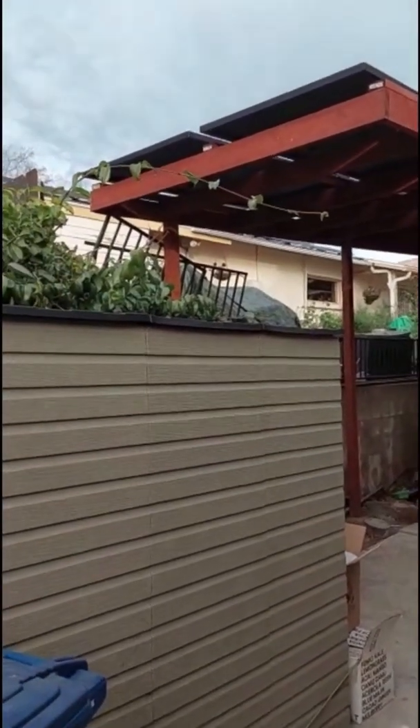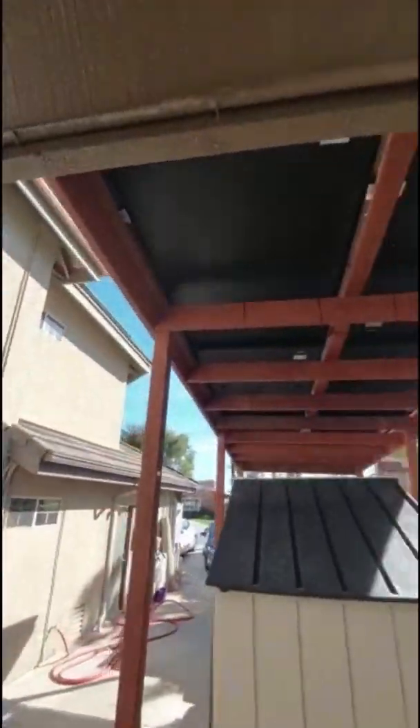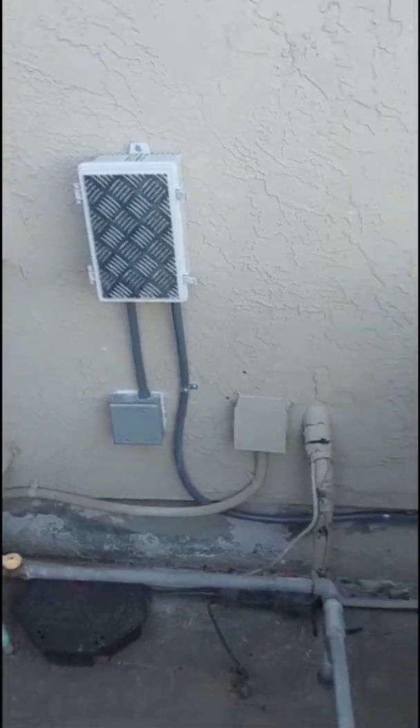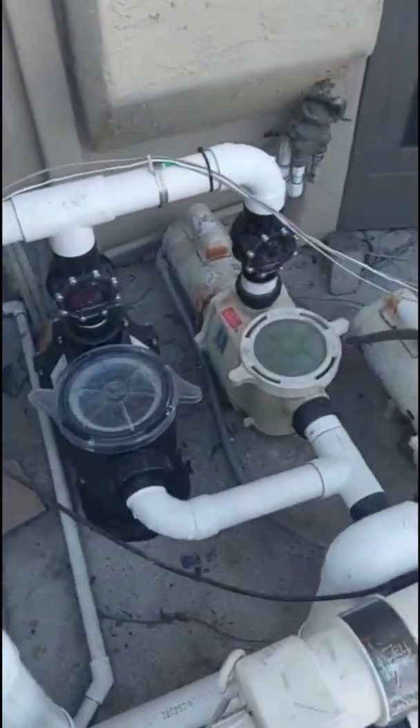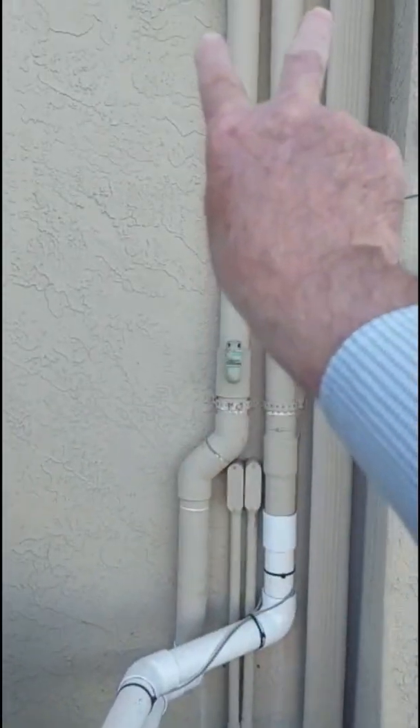Here she is completed. This is the off panel — the panels run here in a perfect spot to collect all the sunlight. It comes right down through here; we ran it into this little house because there's a junction box inside with a bunch of breakers. We've got the AC system there, the DC system there, and this runs to the solar on the roof.